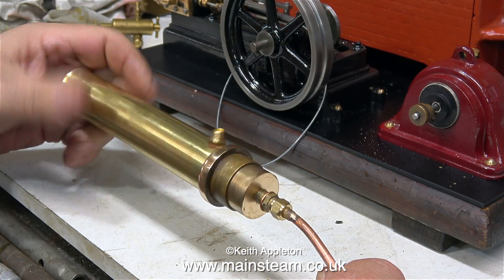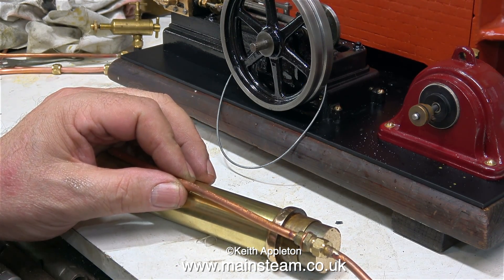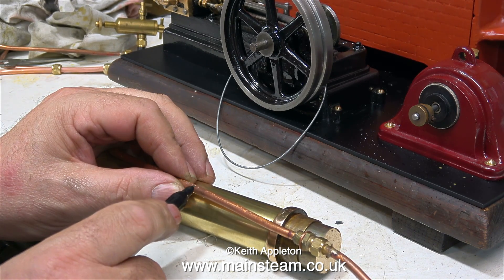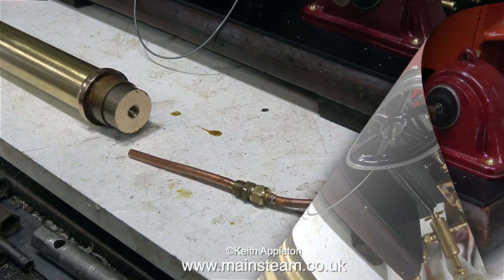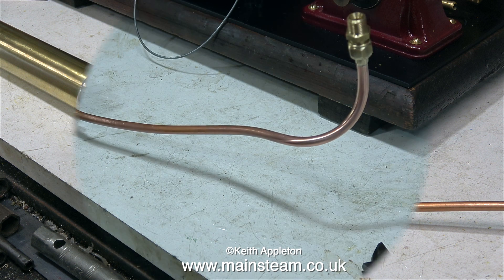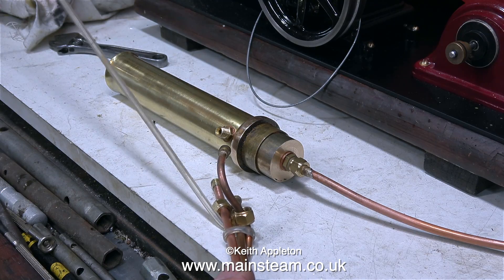This clip shows the removal of the chimney condenser and the pipe, and as you can see it's far too long — it's nearly right at the top of the chimney. I'm just going to chop it in half and that should be okay. I'm marking the pipe with a felt tip pen because it's easy and it just shows me where to cut it. I often use felt tip pens for marking pipes — maybe not as accurate as a scriber, but this is not a precision item. I don't need to put this pipe into the acid bath; I've cleaned up the end and it's nice and shiny — that's the part that shows. The rest of it is inside the boiler.